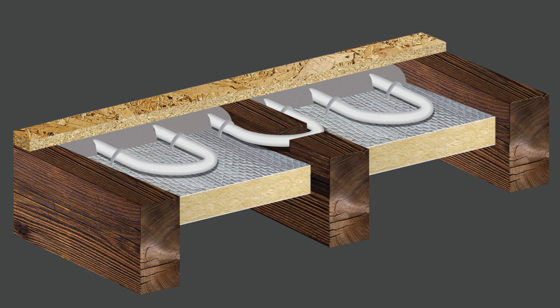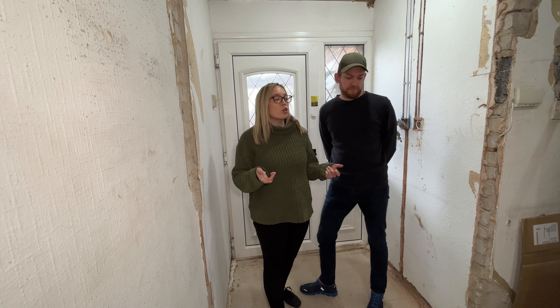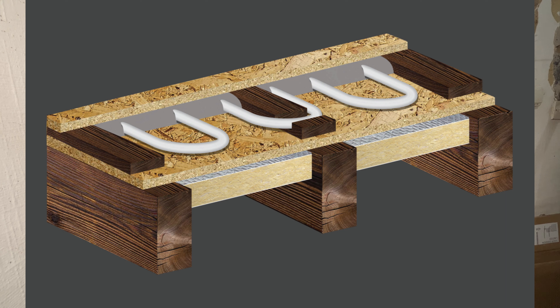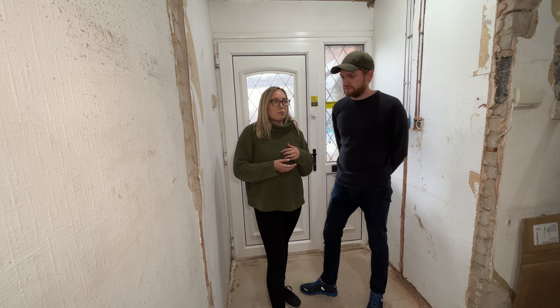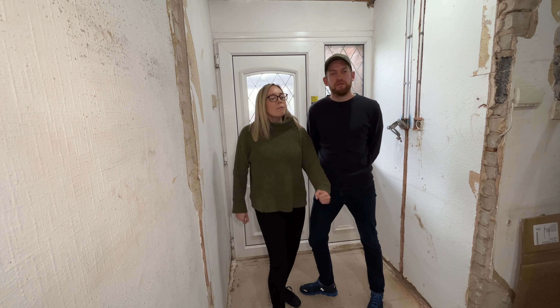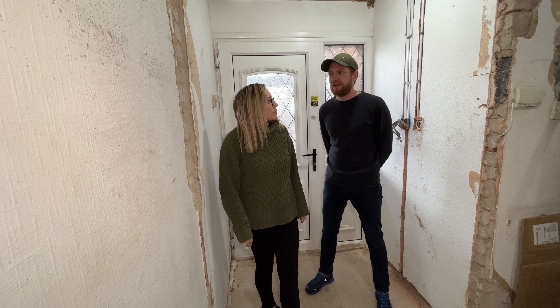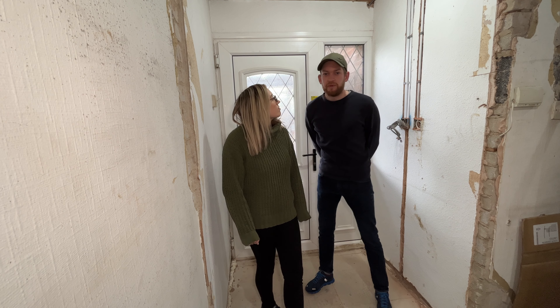I think one of our biggest decisions we had to make early on was why we wanted to do the floor in the way that we did. The ceiling height was the main issue. The way we did the floor build-up wasn't the easiest option. The easiest option is a solid floor construction where you put boarding down, then insulation, and clip your underfloor heating pipe to that. Whereas with ours, we laid the pipe in between the joists, which meant a lot of notching and generally takes longer. But by inserting the pipe within the joists, your floor level stays the same.